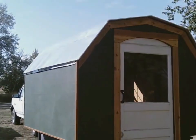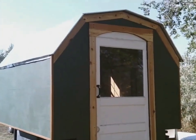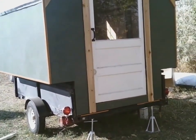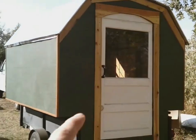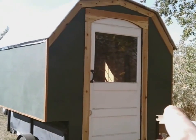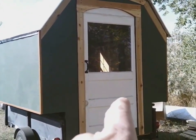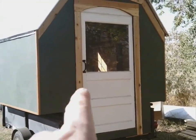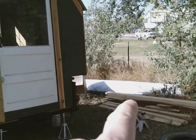This is the camping wagon — shepherd wagon, or vardo. Work continues on it; free plans are available on the website under the micro cabins link. It's designed for five-by-eight trailers with side walls — approximately eight feet long, seven feet wide, and about six feet four inches to the peak, giving plenty of interior room. The recycled door had its bottom cut off and placed on top as an arch, with cedar fence board trim which looks really nice.